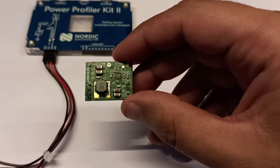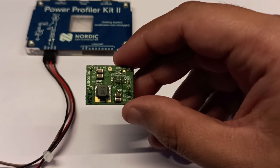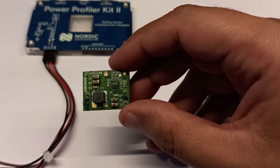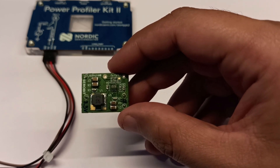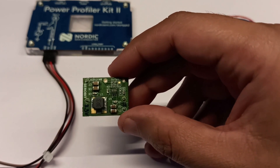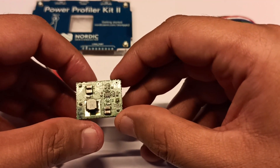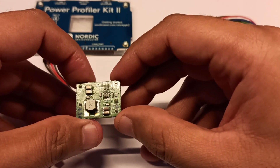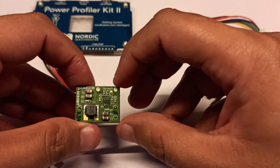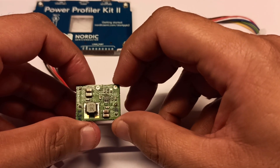For the demo, I will use this DC-to-DC converter module from a company called Serobit. This module takes a maximum 15V input and gives 3.3V output. We are going to provide 5V input and at the output we will get 3.3V, and we will try to measure quiescent current. Quiescent current is basically the current consumed by the DC-DC converter circuit when there is no load. As per the datasheet, it should be around 500 microamperes.